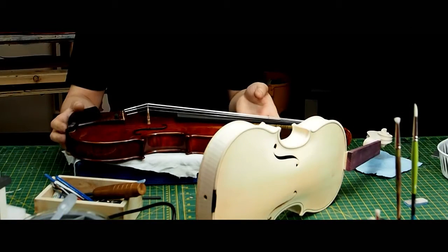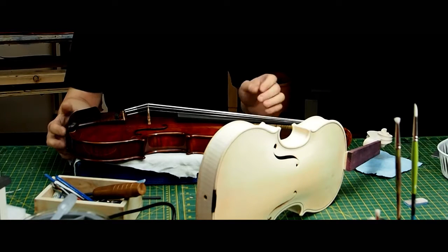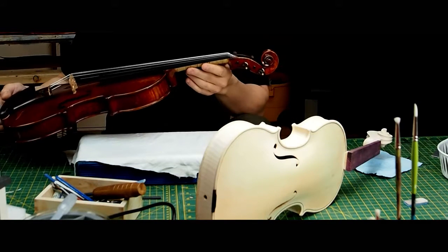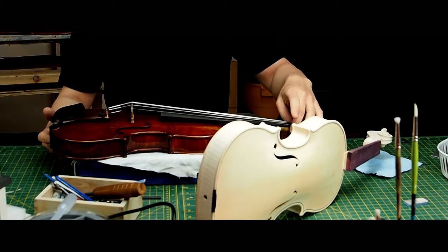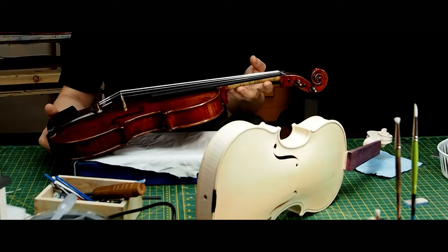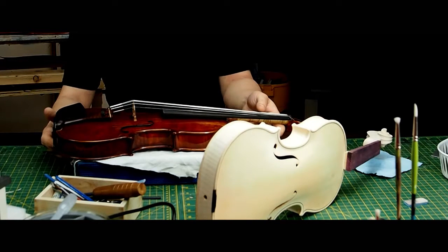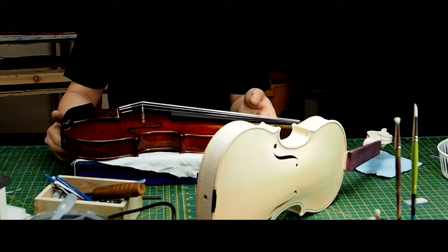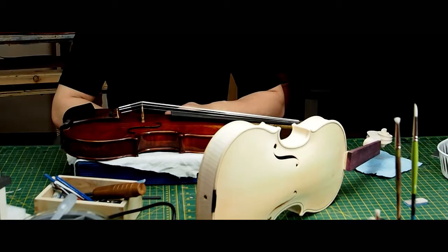What I did for this one is the same model my new violin is going to be. What I did for the neck is run carbon graphite reinforcement in there. What that allows me to do is make it slightly thinner as a neck, and it moves a little bit less between seasons, so if you play outside your own country it will travel a little easier than the regular builds.